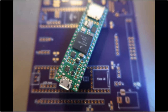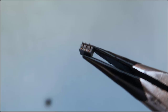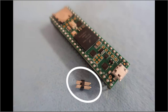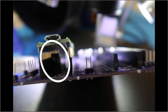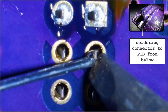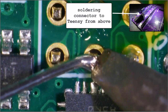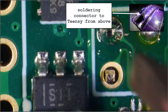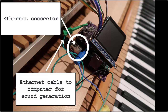For Ethernet, I need to connect these Teensy ports to the PCB. I want detachable processors, so I need a header with this dimension. This is the closest I could find and with two, it might work. On the Teensy, use this connector soldered on the bottom. Here is a side view — the Ethernet connector hits a tight bit. Soldering this connector to the PCB is fairly easy, but the Teensy connector is a challenge because, to get the required precise alignment, it must be soldered while connected. That increases the mass the soldering iron must heat, so I used quite a bit of flux. I also added the Ethernet connector.